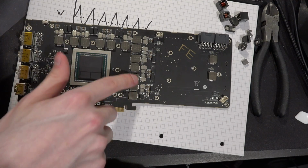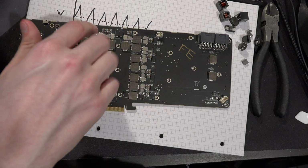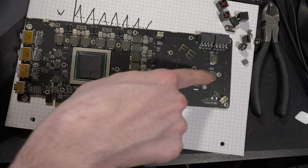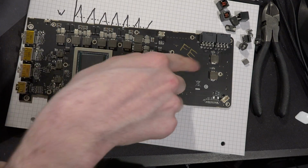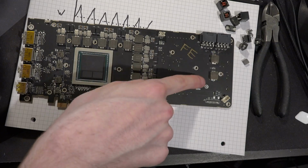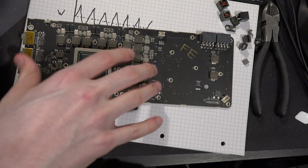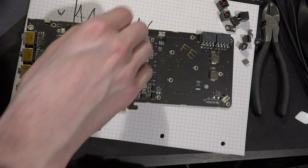But you would have to basically high temp silicone all of your vCore VRM and the input filters for the vCore VRM, because any load current change that happens to the vCore VRM, right? If the GPU core is pulling 50 watts, then it's pulling 50 watts from the VRM. That VRM is pulling its 50 watts from the 8 pins, and between the 8 pins and the VRM are these two inductors. So if the core starts pulling 400 watts, it's going to ask the VRM for 400 watts. The VRM is going to grab its 400 watts through these two inductors. So they're still going to see that load, that current swing change. Now it's going to be reduced because you do have all of this bulk capacitance on the input of the VRM, right? These black capacitors over here, they're there to try to minimize some of the current change swings so that you don't just dump a bunch of noise onto the 12 volts of your power supply.